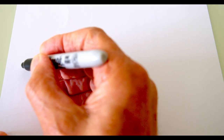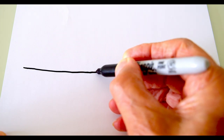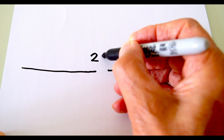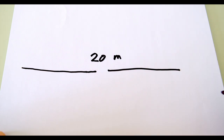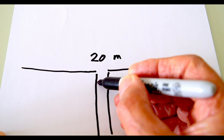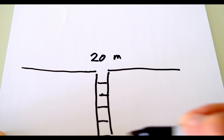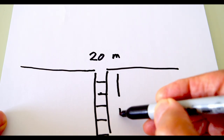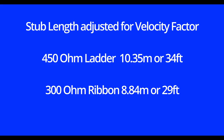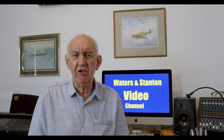Here I'll draw you the basic concept. We've got a basic dipole for the G5RV — it's three half-waves in phase on 20 meters, which gives it that 102-foot length. That top section is fed with balanced line, which can be 450-ohm open wire feeder or 300-ohm feeder. The key is that the length of the matching section should be a half-wave on 20 meters, and you need to allow for velocity factor. Here for your guidance are the stub lengths for 300-ohm ribbon or 450-ohm ladder line, adjusted for velocity factor.